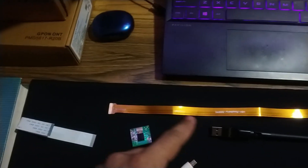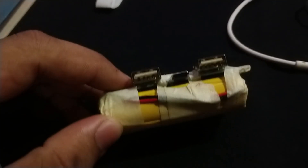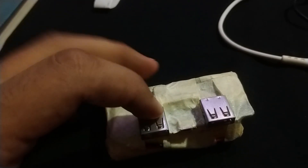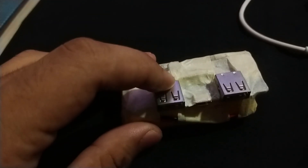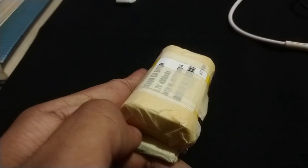You can also buy a camera module, which gets connected via the CSI cable. By default the camera comes with a standard cable, but Raspberry Pi Zero doesn't support that cable, so you need to buy an adapter cable externally. Additionally, we can use a power bank to power the Raspberry Pi. I have connected a 3.7V 4000mAh battery with a power bank module, which is similar in size to a Raspberry Pi Zero, and can power the Raspberry Pi for around 8 to 9 hours.